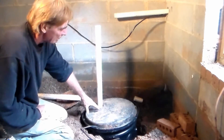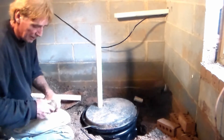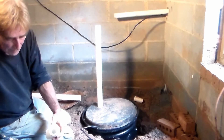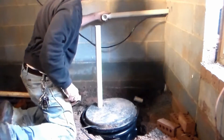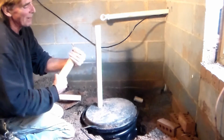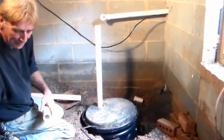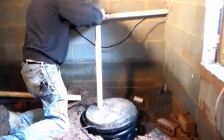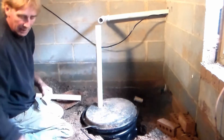We've already hooked up our pump, the check valve, and we've got our riser. Now we're going to put some glue on here and glue our fittings together. We'll start with the actual discharge line over here. You can see we've got play in this pipe so we can easily move it back and forth. We just need to clean the pipe a bit — sometimes they get a little dirty when we're dropping them in the mud, but they work good. Good amount of glue, push and hold, check your connection — you can see it's going to fit real good.